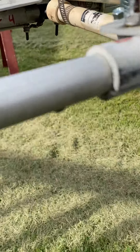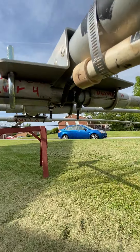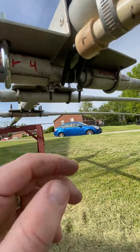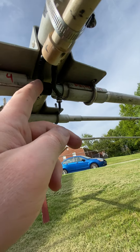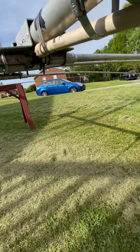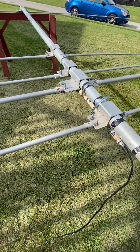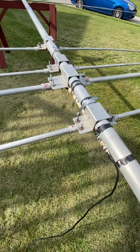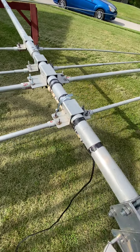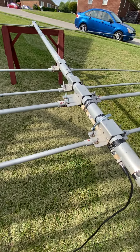Remember this on the Force 12, the older ones - the longer the leads are, either from your choke or from this little one-to-one choke balun, the longer the element appears. So you want to keep that about two and a half inches if you can. I would definitely use some kind of choke on this antenna, because the elements are working as a coupled Yagi system.